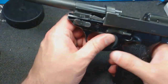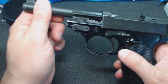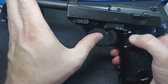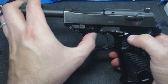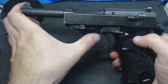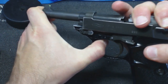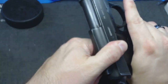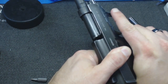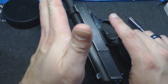To field strip this, it has a very unusual locking mechanism. This is technically not a fixed barrel gun, and it's not a blowback. The locking mechanism is not permanently affixed to the barrel, so the barrel does not tip. When this gun fires, the barrel and slide move back together, then the locking system unlocks, allowing the slide to continue further back. When you pull the slide back, at first the slide and barrel are locked together, but then it reaches the unlock point and the barrel is intercepted by the frame while the slide continues back. It is a locking mechanism, but the barrel is not tipping.